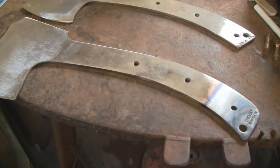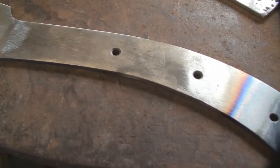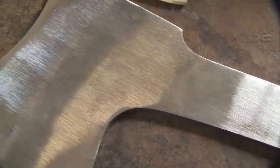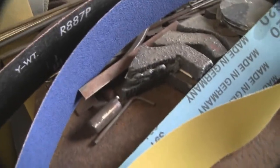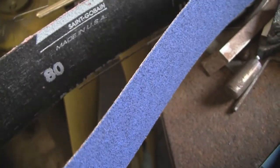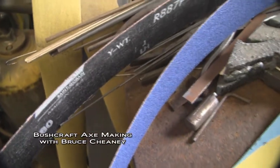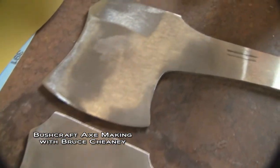There's what I've got so far — that's cleaning up the crust off of the axe right there. I used a Norton Blue Belt, it's a 36-grit. I'll show you a close-up of the texture of that belt. It's a stiff-back belt, and that's what I used to clean both of these axes up with.